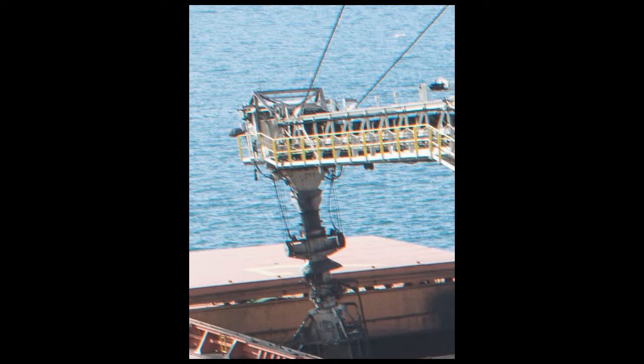On the back wall panel, start with the flop gate washdown cycle. Each cycle is timed for a few minutes. Give the flop gate spray a couple of cycles. Look out the window and see if it's clearing. If so, then give the spout spray a cycle, then the head box. Once unplugged, it's a good idea to go outside and look in the head box to make sure that it is also clear. If so, open your pant leg gate and continue loading.